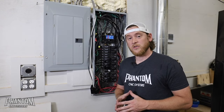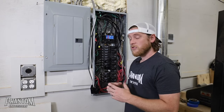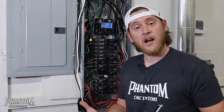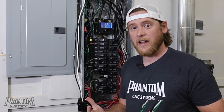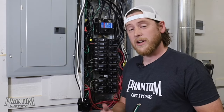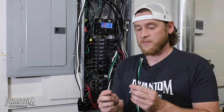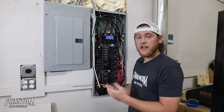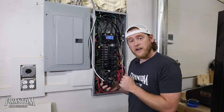When it comes to the electrical hookup of this unit, we really encourage an electrician to do this job for you, but if you want to do it yourself here are some pointers. This unit runs off of a 50-amp breaker on 220 single phase. Traditionally in a shop or garage, most electricians have run 220 lines in 10-gauge wire because there's no need for amperage pulls above 35 amps. But with this setup we're going to be pulling 41 to 42 amps on a 50-amp breaker, so we want to go above that 35-amp load and increase to 8-gauge wire. We already had 10-gauge wire run for our previous 2.2kw vacuum pumps on the 30-amp breaker, so I went ahead and put on a 50-amp breaker with 8-gauge wire for this setup.